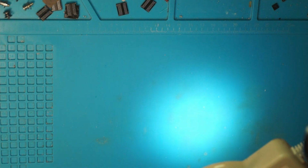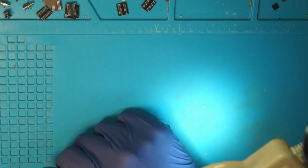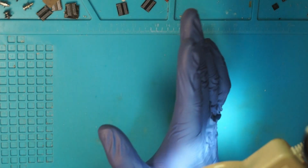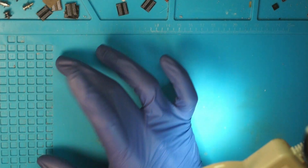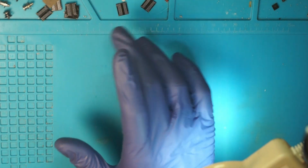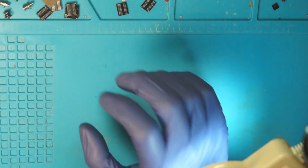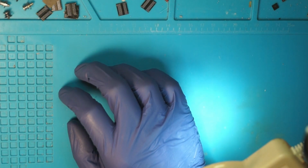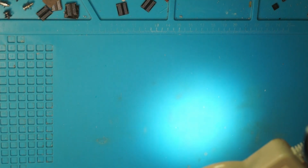Here I would basically take anything, just not one from the plumbing department that's made to solder a roof or something like that. Those won't work, but anything made for electronics is perfectly fine. That applies to everything I say from now on: don't go shopping in the plumbing department. The flux is corrosive, or is made for a different kind of work, not suitable for electronics. That's really an important point that I want to make.